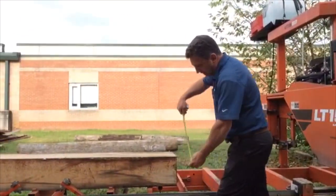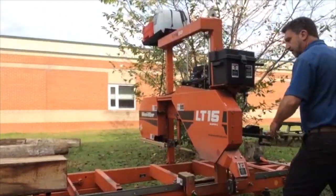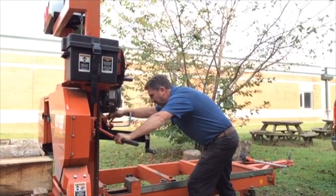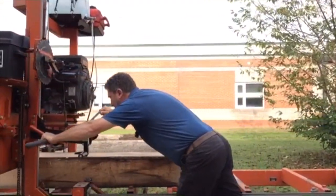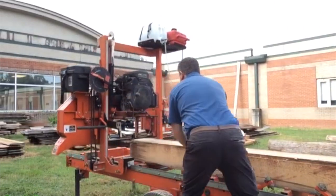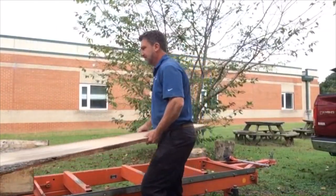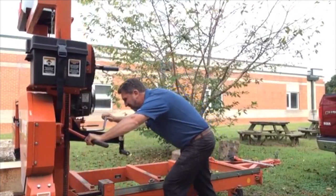It's a good time now to take a measurement. I've got 9 inches one way and 10 inches across the other way — I like that 10-inch. I'm looking at the pith in the end, the center of the log, and I can see some good boards coming right off the top of this. We're going to leave this log laying where it is and take a one-inch board right off the top. When I say I'm taking a one-inch board, I actually add an eighth of an inch to it, so I take a one and an eighth — the tape measure on the saw tells me the measurement. Here is our first good board coming off there. It's got a little bit of bark on it, but not much at all, and it could be used as an inch and an eighth. Throw the hammer and away we go — board after board after board.